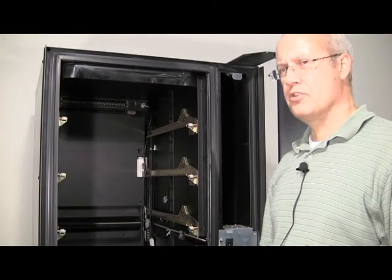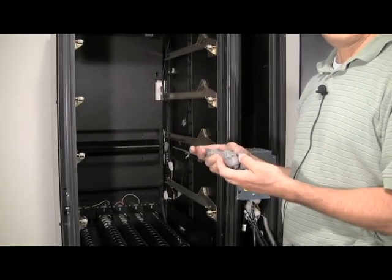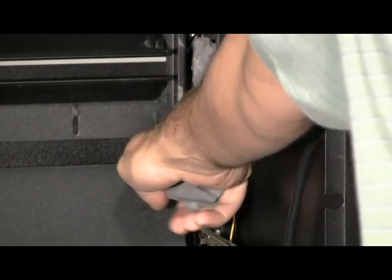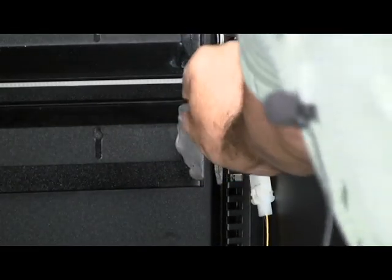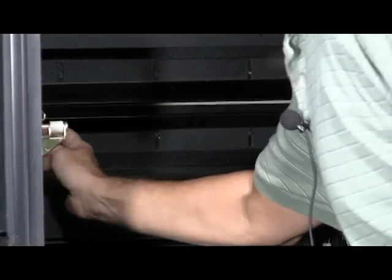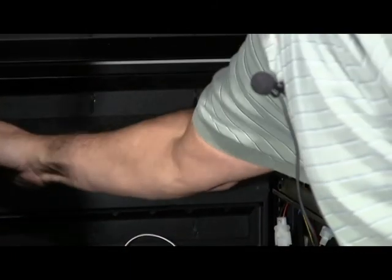In preparation for installing the insulated barrier, we need to seal the bottom turning vanes with permagum that is provided in your installation kit. We will install the permagum in this side corner of the turning vane and then the opposite. Take a good sized portion of the permagum and mold it in, on both sides. Work it in good and tight so it won't fall out.